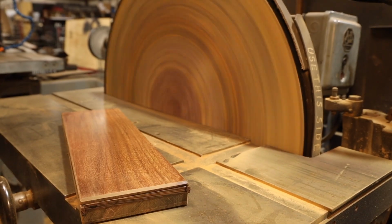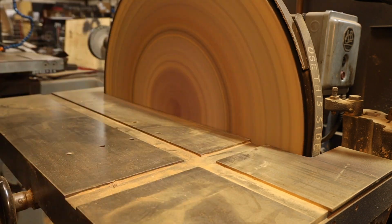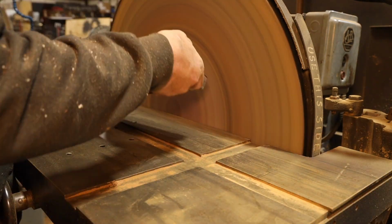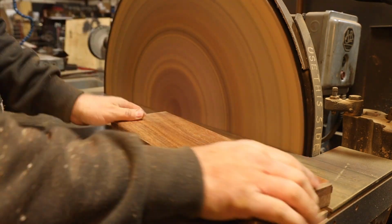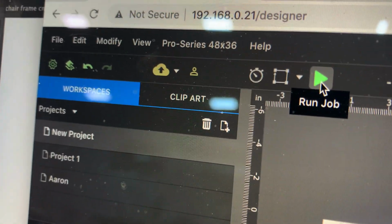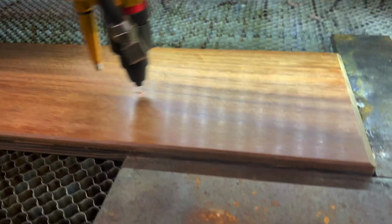So now the top of the lid is puzzled onto the bottom, and now I'm just sanding everything to be the exact same width. Because I left everything a little bit proud so that I could sand it all together. It's pretty. I like that it looks like just a block of wood from a distance. It's very deceptive. And so now this is stealthy.